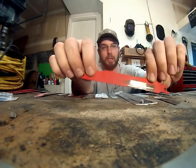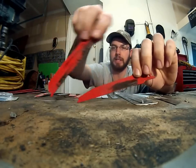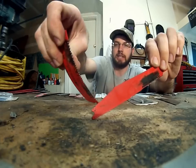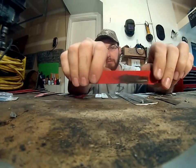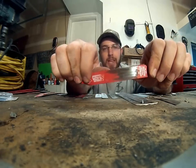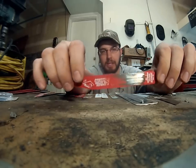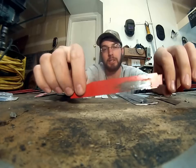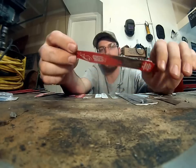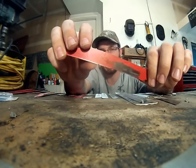This one did really well right up until the end, because it's a solid strip. These have individual pieces of carbide brazed onto each tooth — when this flexes, it doesn't affect the cutting edge. However, when the solid strip one got hot, the metal backing flexed, and because it's one solid piece of carbide with little teeth instead of individual chunks, that's when this blade broke down and failed. So when you see this one at the store, keep that in mind. This blade will cut, but if you get any binding or flexing, it's not going to hold up and the entire blade is going to be destroyed.